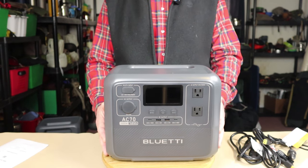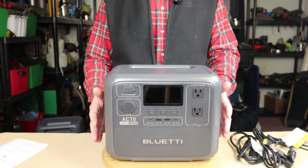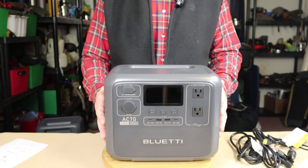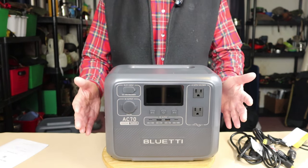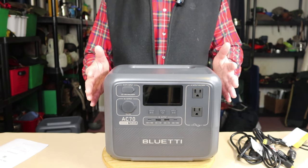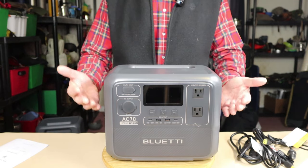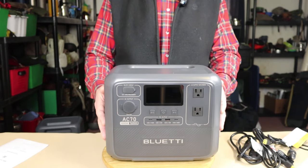There's also the power lifting mode, which will allow you to power things up to 2,000 watts. This has a 1,000 watt inverter, meaning it will run electrical devices requiring 1,000 watts. Some devices need a starting energy higher than 1,000 watts, so it has a surge capacity of up to 2,000 watts. It can also be set to a 2,000 watt power lifting mode for devices that run at higher than 1,000 watts — however, they have to be a resistive load; it can't be things with motors.